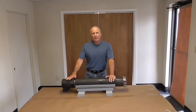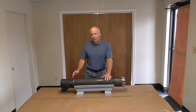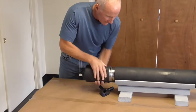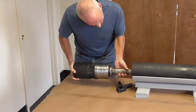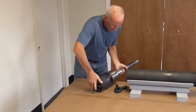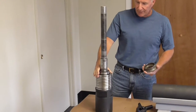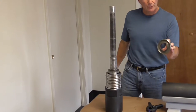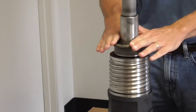Today we're going to take apart the back head with the intention of going through the back head assembly and showing you how to replace the collection tube, which is a critical wear item in an RC tool. The back head is loosened so we can just unscrew it — in the field it might take some different tools to do that. One thing to watch when you take the back head assembly out is that there may be some loose parts on the inside. They are the makeup spacer, which makes sure all the parts on the upper end are maintained under tension — similar to a makeup ring used in a lot of down hole hammers — and the valve, which is normally right on here.